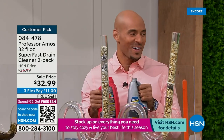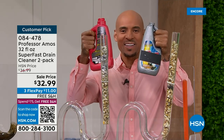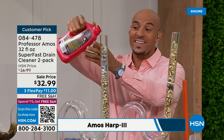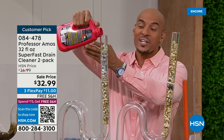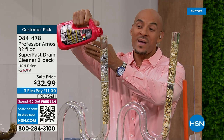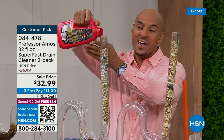When you get a clog at home, usually you're in a panic state of mind. You'll do just about anything to get those drain lines open. So when you run out to the local store and you get a consumer product like this, you're doing more damage than good, and I'm gonna explain that. Products like these are highly corrosive. They may contain acid, ammonia, bleaches, and animal fats.